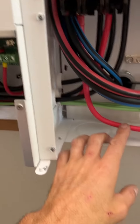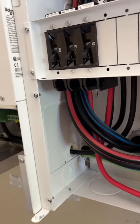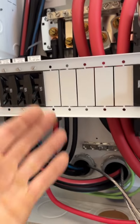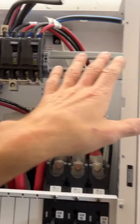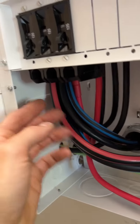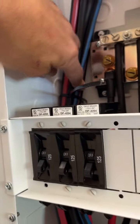So RW90, it's great at this stage. It's not awesome in the process, and of course this is fairly loaded up. You fill up your box. I couldn't imagine having more systems. This is a big system. I would not go with stiff wire. You would need flexible wire to be able to work if you had more systems running into your PDP, because you can't flex around each other enough. I'm already working a bit to get my positives up to these, and it's right there. This guy's over, and I already got that zapped over to the wall.